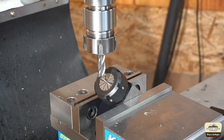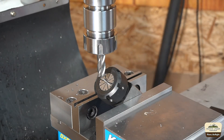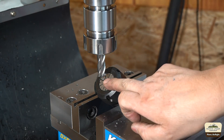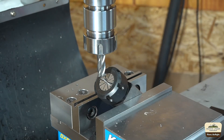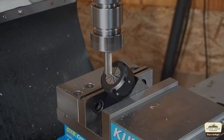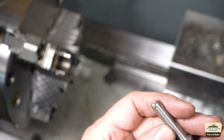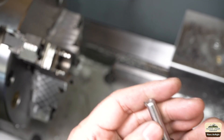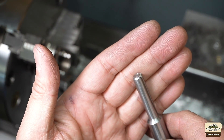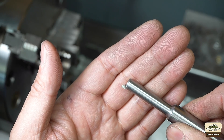This is 1-1/8 inch O1 tool steel, obviously in soft state. We're gonna machine a 45 degree angle and that's what's going to clamp down on the high speed steel tool bit. I quickly assembled it, took it to the grinder, and ground the tool bit. It's so tiny it's hard to see to grind.